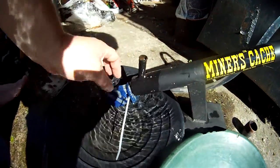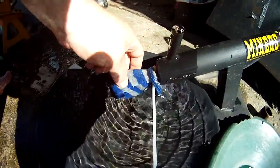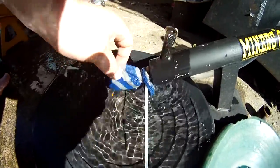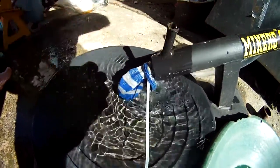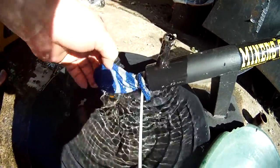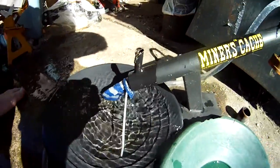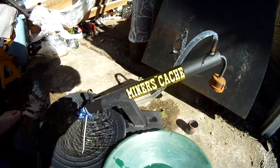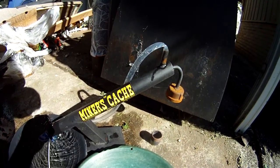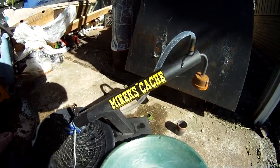All it does is cool the inner tube to condense the mercury back down to liquid elemental mercury. It collects in here, rolls down, and comes out the bottom tube over here — which you need to leave above water — into your fabric or sock or whatever you're using. I'm using a really tight-knit sock. The purpose of the sock is in case any vapor gets down there; it will condense and just shake out. It's a great system. If you guys are interested in picking one up, Chip at the Miner's Cache sells them — just Google search the Miner's Cache, Redding, California. Give Chip a call and I'm sure he'll be happy to ship one out to you.